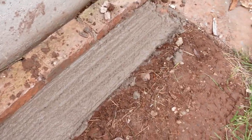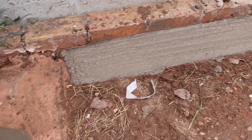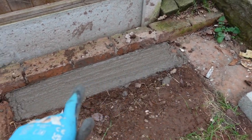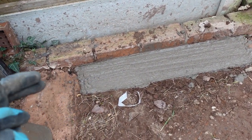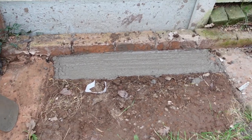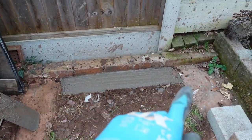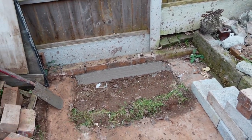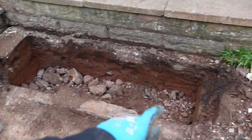The first trench is done — let's take a quick look. All I've done is tamp it down with a piece of wood to make it nice and compact and level. Just before I let it go off I'm going to put a spirit level across the top and make sure it's really nice and level, which will make brickwork a lot easier.